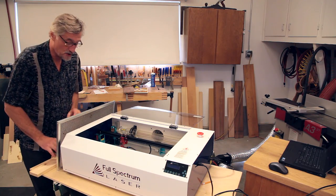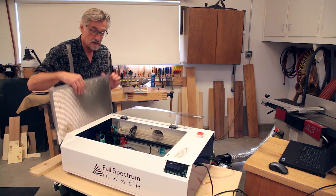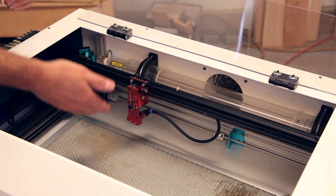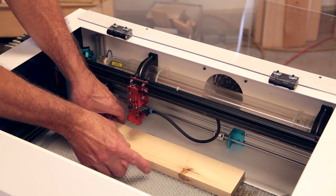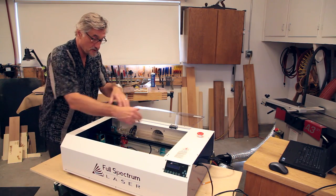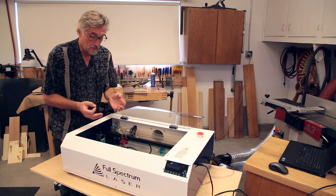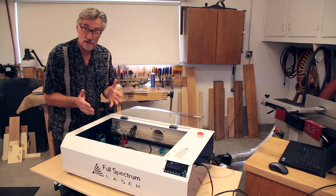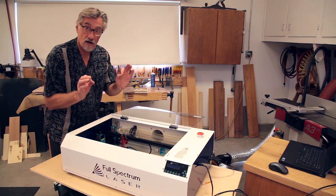One more thing: if you're cutting material, you need to space the workpiece above the floor of the machine, otherwise you'll burn it. So the machine comes with this grate, which goes in here, and once again you can align it with that line you made earlier, then lay your workpiece in here and align it with the edge of the grate. This is a very accurate machine, and this alignment of the workpiece to the pencil mark is probably the least accurate part of the job. I recommend when you're cutting or engraving something, the workpiece should be a little bigger than its final size. You can cut it at the end on a table saw or band saw, or if it's a quarter inch thick or less, you can use the machine to actually cut the final dimensions of the workpiece.